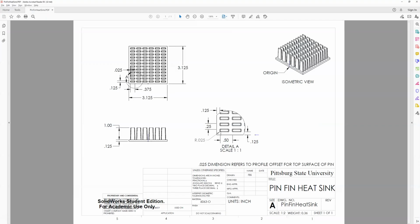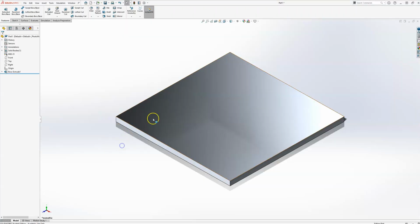So we're going to use a Loft Tool to do that, so that's a little bit different. With the Loft Tool, one of the things we're going to do is make two different sketches that are going to be consumed in the one loft feature. We'll make a sketch here on this bottom plane, and then we'll make a sketch here on the top plane as well. That'll allow us to describe the cross section at both of those 2 points, and then we're going to use the Loft Tool to map the geometry in between those. And this idea of mapping the geometry in between can become as complex as needed. The finalized one you see on the drawing here is very straight. It's just kind of a linear mapping between the different control points on both the sketches, but you can do something more exotic as well.